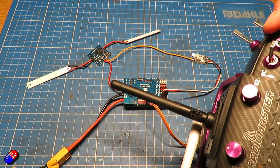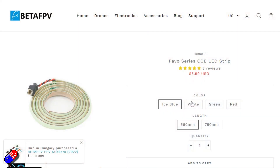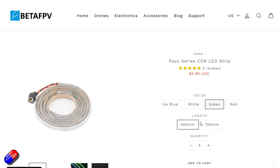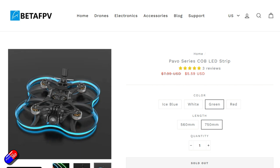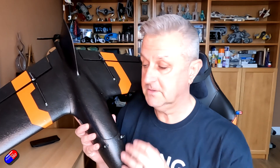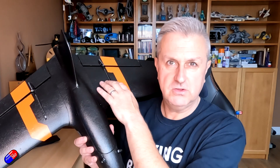Those are the three main ways to do it — it isn't particularly tricky. My personal favourite for wings like this, particularly if you want long runs of lights, big lines of lights, almost Tron-esque, is the BetaFPV COB strips. If you want smaller, different-coloured little bits of light that you can sink into the wings, the Menace RC COB stuff is really nice too. You can absolutely use generic COB LEDs from anywhere, so long as you follow the wiring approach. One last bit of advice: COB LEDs can get a little bit warm, so be careful when sinking them into foam. I tend to cut the recess a little bit deeper and back them with something like a thin strip of balsa or similar, just to protect the foam from getting damaged or deforming if it gets warm.